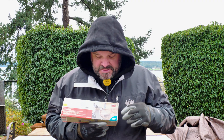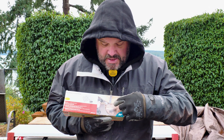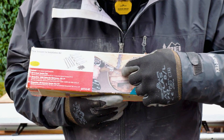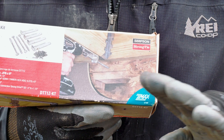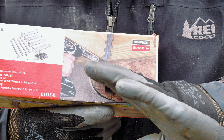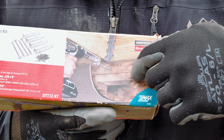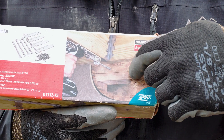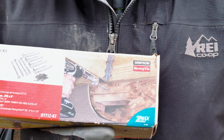The main thing is — this is like a cutaway — you have to attach to the top plate or some kind of a sill plate. You can't attach to, let's say, the floor joists that come all the way out. You have to attach to the top plate, a mid plate, or something like that inside the wall. So you have to verify to make sure that you have that.